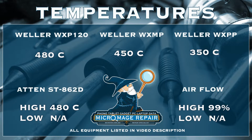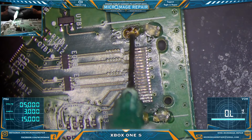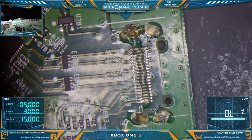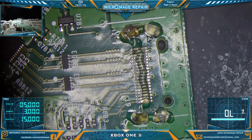Okay. Back to microscope. So what I want to do here is probably flood those anchor points with low melt and make it a little easier to clean. We might just go ahead and flood the pads with them just because we'll have low melt on the iron anyway. So that will greatly reduce the melting temperature of the solder. By greatly reduce, I mean greatly reduce.